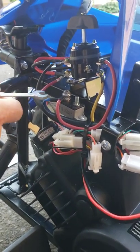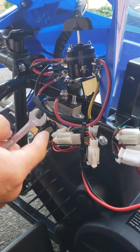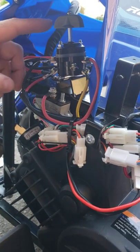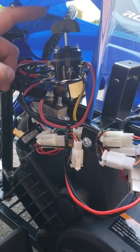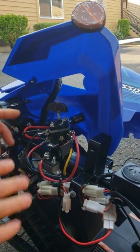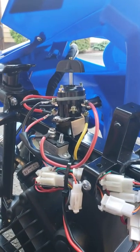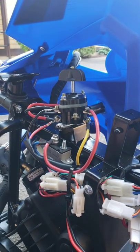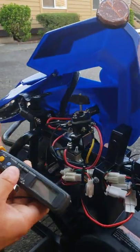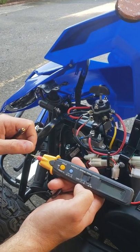But what if you touch those two wires together, you override the relay, but the machine still clicks but does not move? Well, that could be a problem with your forward, neutral, and reverse switch. And unfortunately, if you don't see any visual defect from the outside, you will have to get it tested. You will need a multimeter and you have to do the continuity test on this switch.